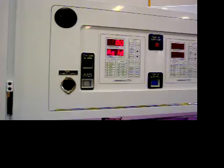So what's too hot to drain? I would say the suggested temperature is 30 degrees C. 30 C. Okay. The liquid level on the tank, the graded area, that's the minimum liquid level allowable. It's hard to see. That's the operational level. Basically, the graded area.